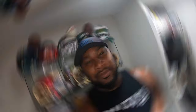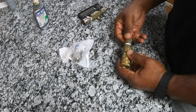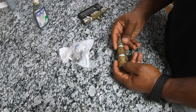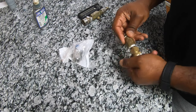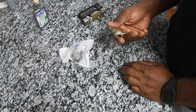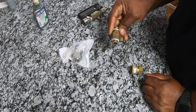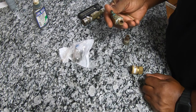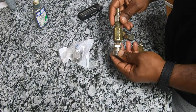So let's move over here to my workshop to show you guys what it looks like. Right here is my regular downstream injector — my General Pump downstream injector — which comes with most pressure washers and most guys use this one too. It works fine, there's no issues with it whatsoever. I used it for a while before I got the new one. This injector usually puts out a one to two percent dilution ratio. This is a 20 percent injector — this is the one I used when I had my five GPM machine. It works really well, just a standard one, comes with a ball and spring inside.